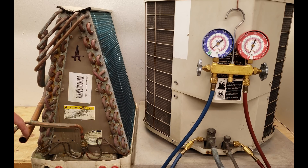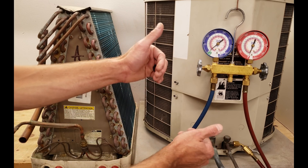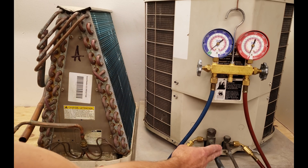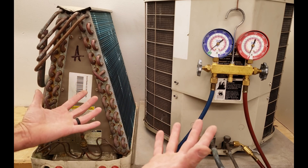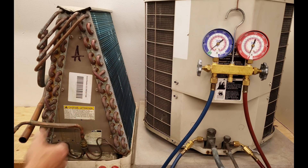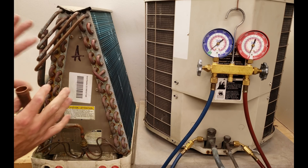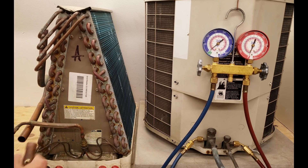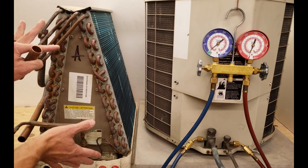By the time this vapor refrigerant ends up at the outdoor unit, it's called total superheat because it has to take into account any change in superheat from the evaporator coil exit to that point. Why do we check it at the outdoor unit? It seems like it would be more accurate to check it at the indoor coil. Reason number one is you usually do not have a vapor pressure port right on the outside of the evaporator coil box, which you'd need to convert pressure to saturated temperature and determine superheat.